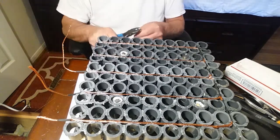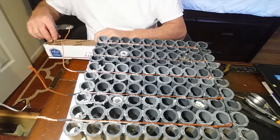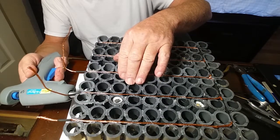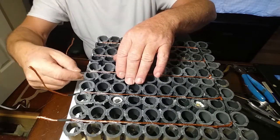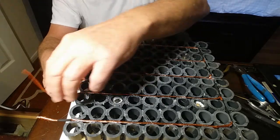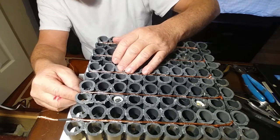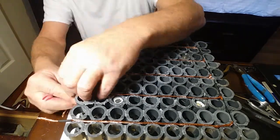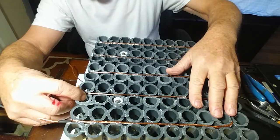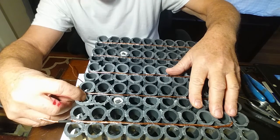There's enough wire on the three metal ones left over. I'm using that fine thread for the ground side when I solder the batteries onto these bus bars, so none of that's going to waste. That center one has enough left over to do four batteries, and the two on each side of the center have enough to do two batteries. That little bit of wire hanging off the most free there solders in all the batteries on the negative side.